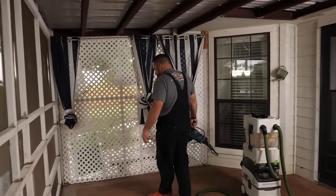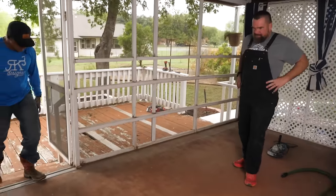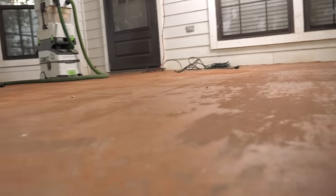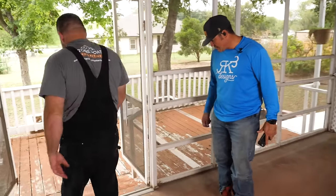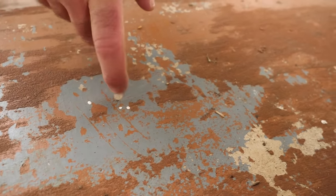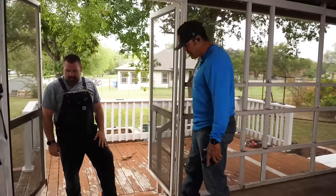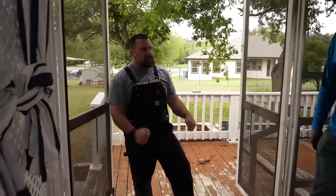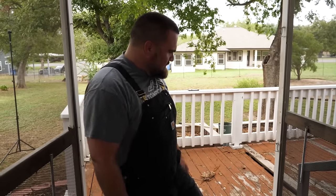This looks like it's been painted and then an overlay put over it — like they textured the paint for more grip. It's odd because I see spots where the gray's underneath. We're gonna have to peel all this up because it's flaky. There's all sorts of stuff going on here. We want to get down to raw concrete. We might see cracks — maybe that's why the paint. I've exposed cracks as I've ground before; the cream covers it and then right below you find them. The flake hides little stuff like that — if a playing card won't fit in it, you're not seeing it.